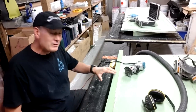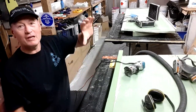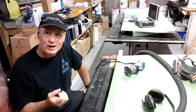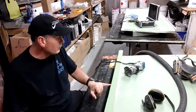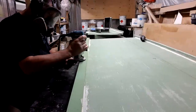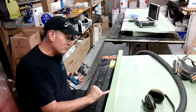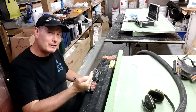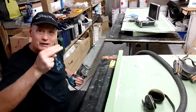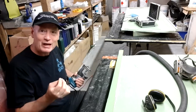We've got this large flat piece of unlaminated foam glued in place, which is going to be a handhold for underneath the roof. It stands to reason that it needs to be rounded - we don't want any sharp edges, particularly if you're coming up underneath and hitting your head. I'm going to route this section with a small corner router and round it right off. I also need to round the top side and the inside as well. It's very important that you don't have 90-degree right angles because if you do you're not going to get a good layup of glass - imagine the rail of a surfboard, how it's rounded so the glass will laminate over without getting air bubbles and bridging.